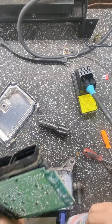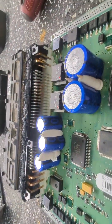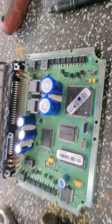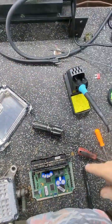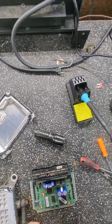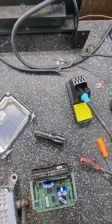I'm gonna pause the video, get my solder station fired up, and get some capacitors and flux out. Before you start: you're going to want to either take pictures or do what I'm doing — take a black sharpie and make a dot on the board where each negative side of the capacitors is, because they are polarity sensitive. You do not want to put them in backwards — you will destroy the board in less than half a second. After we're done I'll take a q-tip with electrical cleaner and wipe off the sharpie dots.